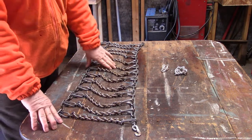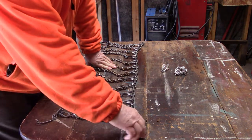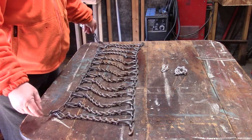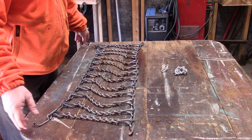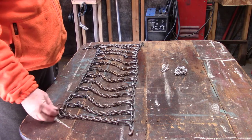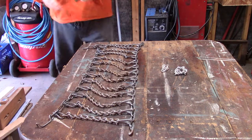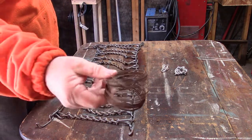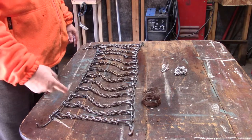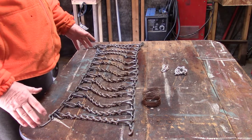There are pieces of equipment in there that chains could hook on. So I like to put the squeezable link on the inside and the disconnecting flexible link on the outside — that's just my preference, it makes it easier to put them together. Also when I put these chains on and link them, I like to wire them closed. I just use bailing wire — a couple wraps around where the link hooks, twist it together, cut it off, and fold it all in nice and tight so there's no loose ends sticking out.